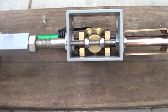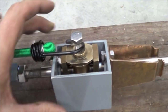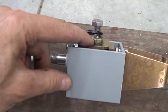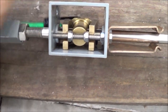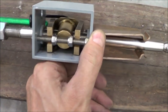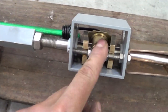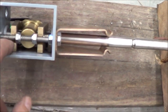So here's your basic brake box, and I've got a bungee cord attached to this side. It's pretending to be resistance from the bucket. That's where the bucket lever arm attaches, right here. And you'll note that despite some tension in this bungee cord, the brake box is not moving. So it's holding position. If I reach in here and push with my fingers, then I can slide it, or I can make it go the other way. So the bungee by itself won't do it because it's putting force only on this brass fitting. It's not affecting the ends of these locker things in here.